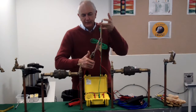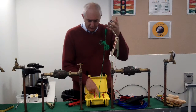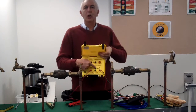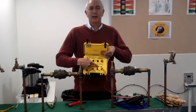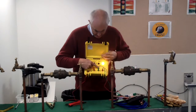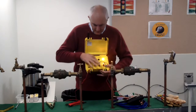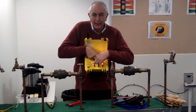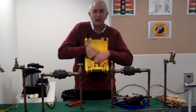For instance, if we disconnect one of those leads to simulate a fault, then push and hold the test button — we do not get the LED on that side flashing. So you can only have two flashing now. We have the big one and the smaller one, but on the other side there's no LED flashing above the lead. That means that lead is broken or ineffective, not working, and needs to be checked.